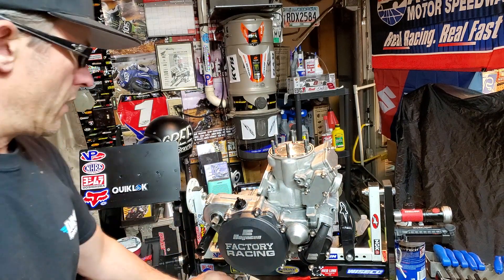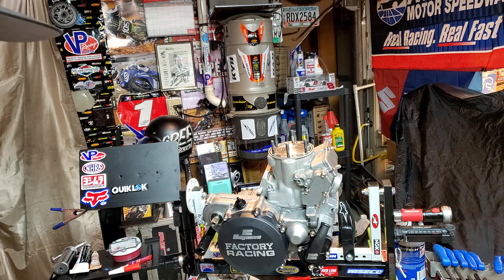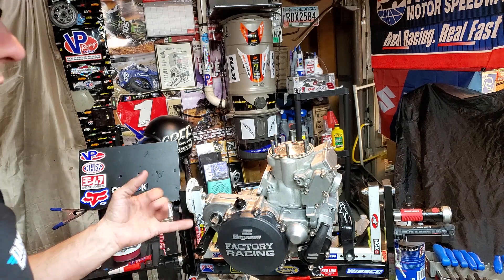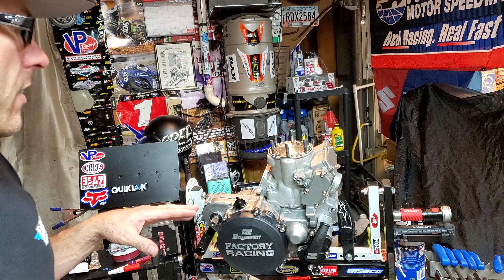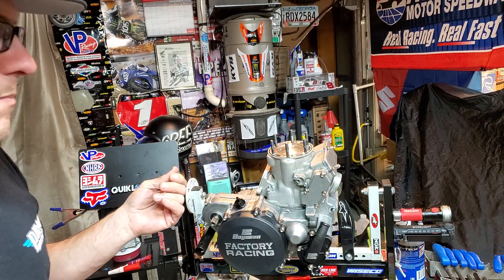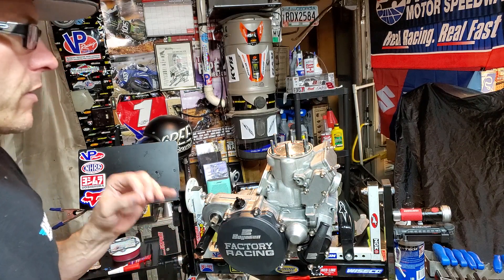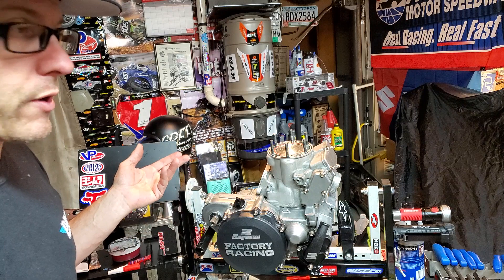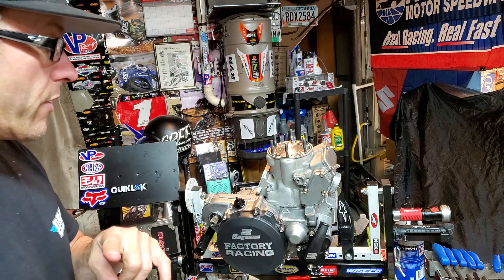It's going to be bad to the bone — can't wait. This is actually a 270cc build, somewhere around there. It was a really good runner but due for a full bottom-end rebuild. We found a transmission bearing that was failing — that's how this all began. We found little shards of metal attached to our magnetic drain plug, which I highly recommend if you don't have one. It gave us advanced notice something was going wrong, so nothing bad happened — the motor didn't lock up, no seizing, and we didn't even damage the cylinder, all because of a magnetic drain plug.